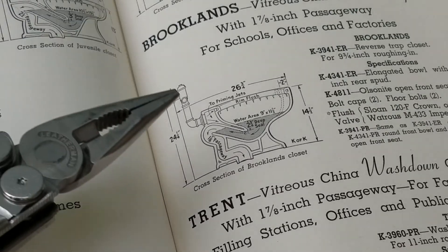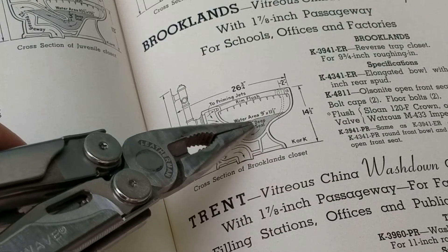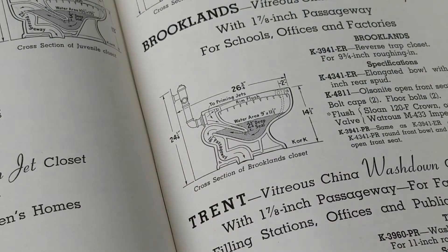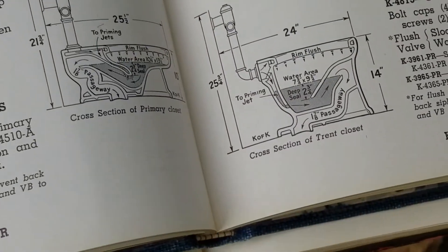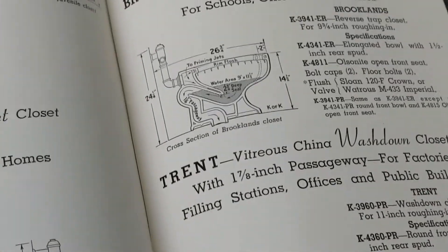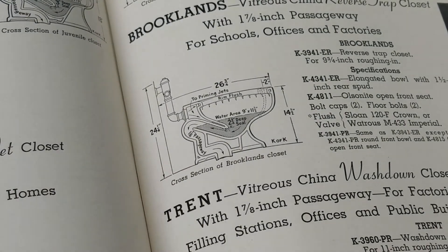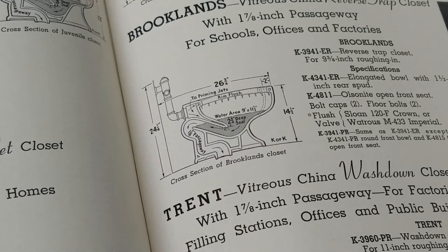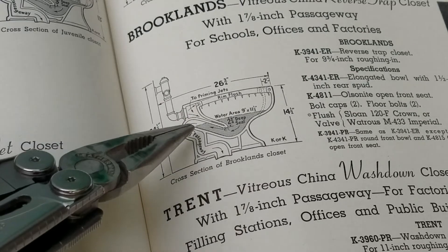The characteristics are similar — it's a two and three quarter inch seal depth. The passageways on these toilets are also very small: inch and seven eighths. On the Trent it's inch and seven eighths; on the Brooklyns it's still inch and seven eighths, though later versions were two inches. Believe it or not, most wash down toilets have an inch and seven eighths trap way, even the modern ones — yet they flush real well.